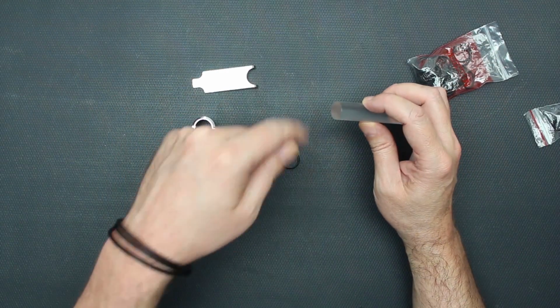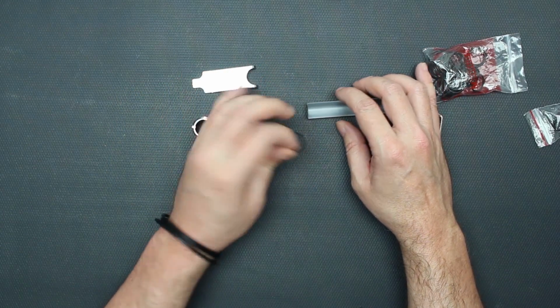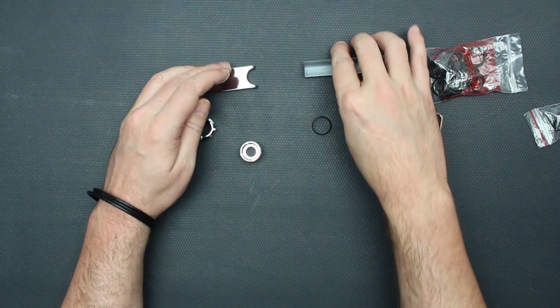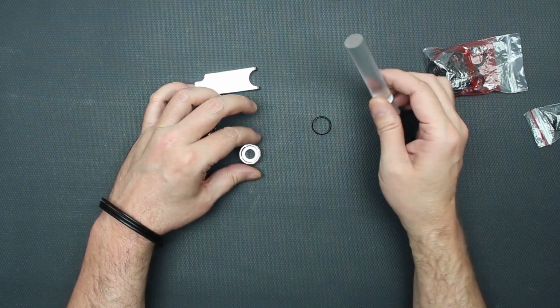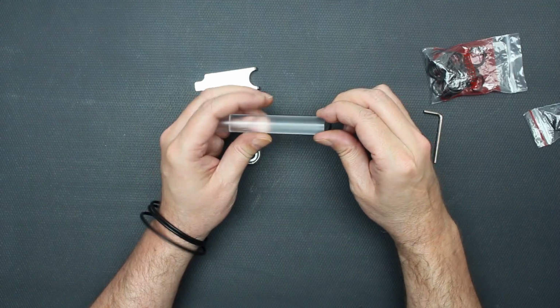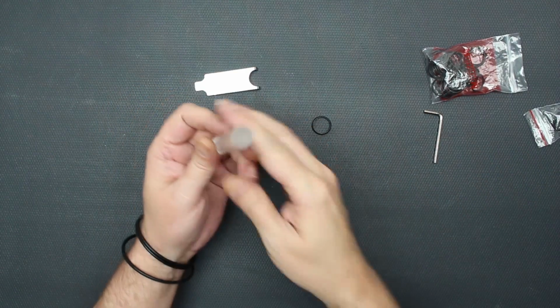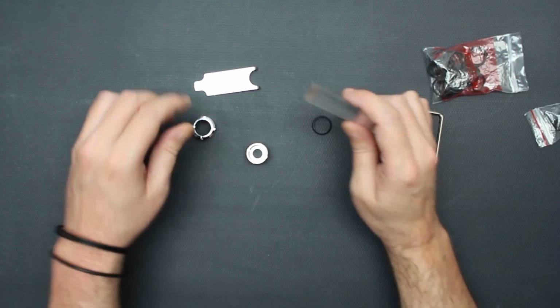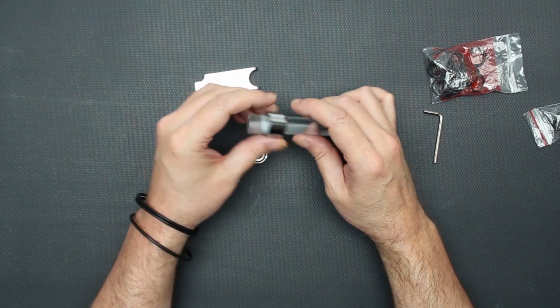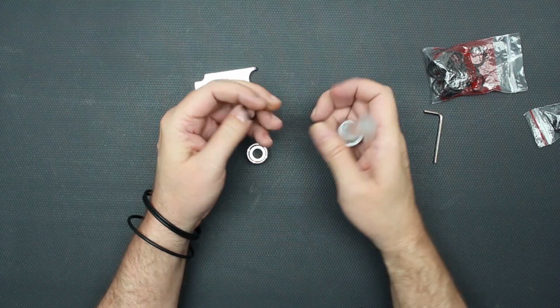So we're going to assume that I have cleaned off the edge of my tube, I have washed off the end and the ferrules, my O-rings are nice and clean and installed. First thing I do is, you can't see it here, but I'll just wet the end of the tube with a little bit of spit. Don't use any kind of lubricant for the same reason we just discussed. Oops, got ahead of myself. First, slide on the compression ring. You're going to slide the ferrule on.